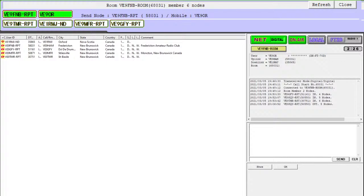I don't really have space to do HF beams, but I do have a few VHF and UHF ones, and I did just last year make a custom 7-element, 10-foot, 2-meter beam, and I do need to play with that and fine-tune it a bit further, so I find those things challenging. It's all computer modeled to try and optimize performance for the boom length. And anyways, I guess that's it from Victor Echo 9, Oscar Romeo.